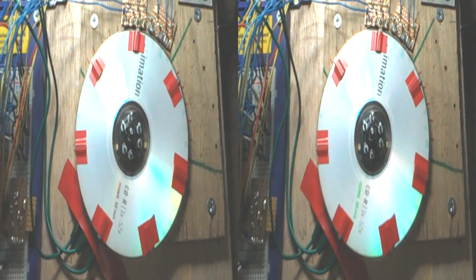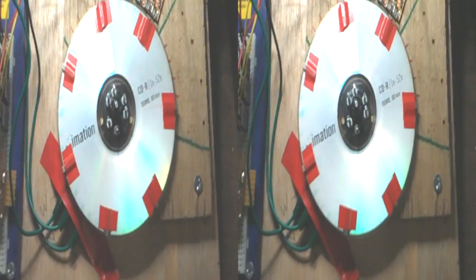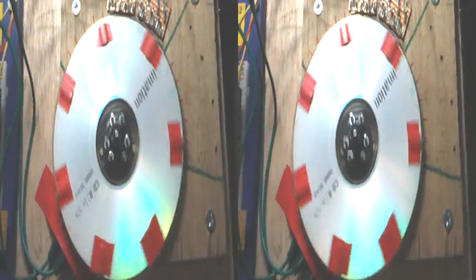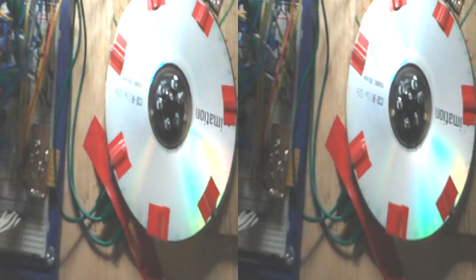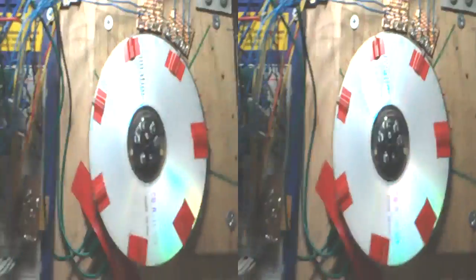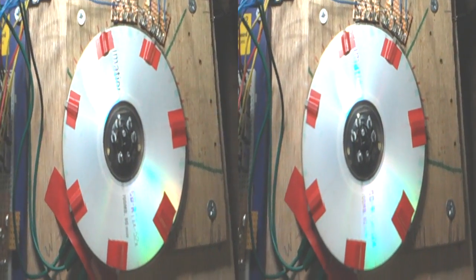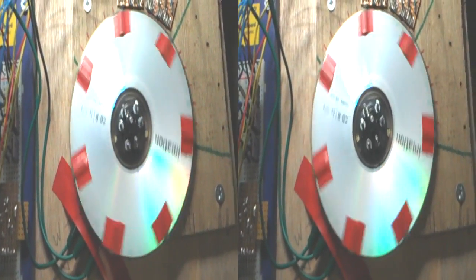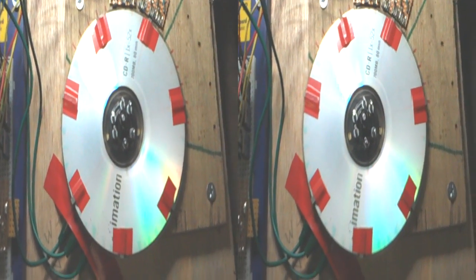Now, bearing in mind that this is under a PWM controller, there's no sensor input at all. If it was in a real motor, what these glitches would do is it would simply skip a sensor reading or a field calculation, and then carry on the motor. So whilst it's obviously not great, because we could do with getting rid of those, and I can find out how to get rid of those, for the most part it's working fine, it's just the odd glitch.